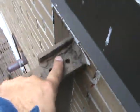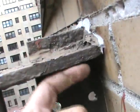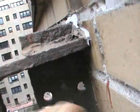Okay, we're doing number 7 down to number 6. Any welded connection, I need you to create an angle bracket over here, bolt top, bolt bottom. We basically eliminated the need to verify, X-ray or load test that weld. Any welds found on this job have to be backed up by a bolt. No welds left behind without a backup bolt. Let's go down and talk about the brackets.